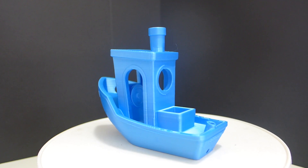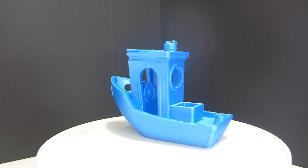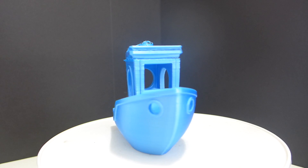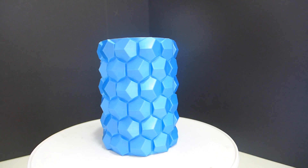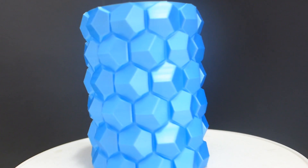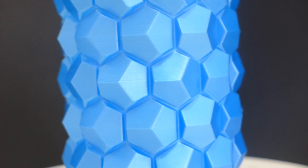I don't know what the deal was, but that other one just did not come out well at all. Here's the under-extruded one that ended up failing. It works pretty well throughout the base of the model, but once we started to get more retractions up through the cabin, it just got worse and worse — more and more skipped layers, you can see the dots up in there, and then it just failed. But when you look at a vase mode model, it just looks absolutely perfect. No under-extrusions anywhere, no flaws anywhere. The shine from different angles is just great, and this filament looks great when printing in this mode.